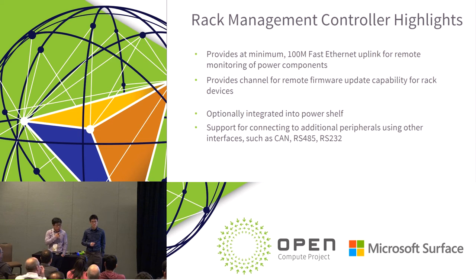I think to your first point, 48 volt is still a bit new, like you said, in some of the areas, and you talk about the maturity of the 48 volt system. When we design the 48 volt system, we really look at the whole system, the power delivery all the way from AC to 48 volt to point of load: how you make your battery, how you design your bus bar, how you make your connections, and things like that.